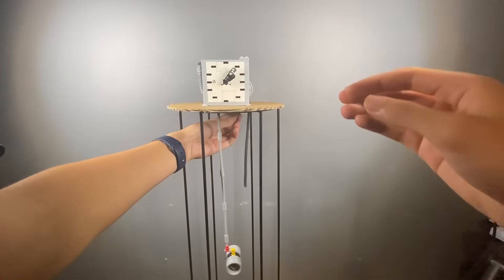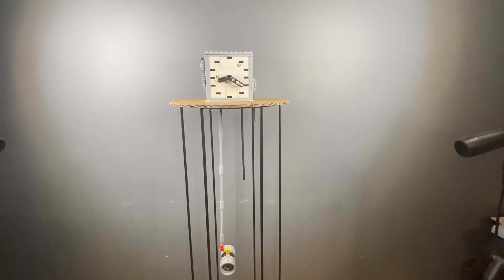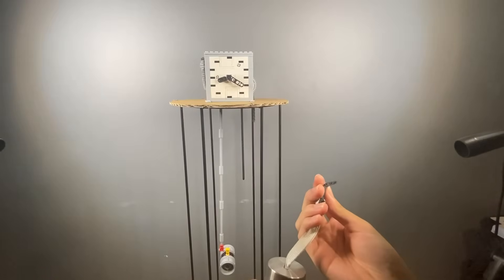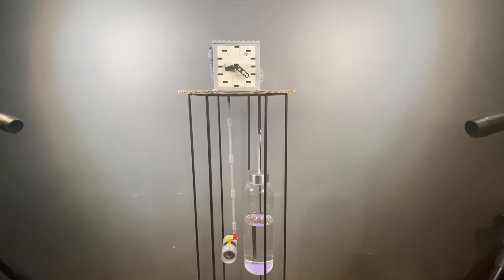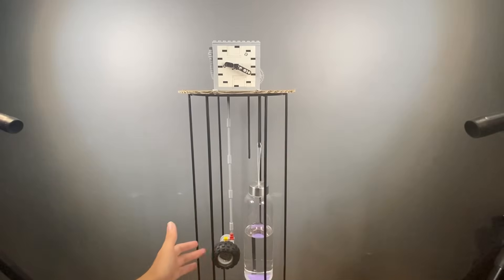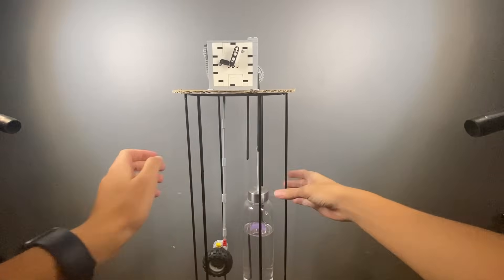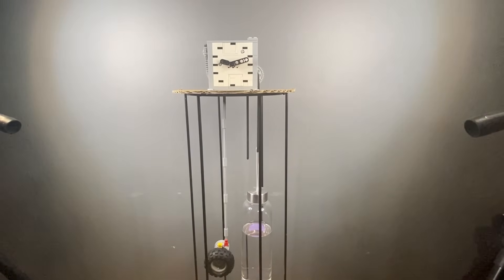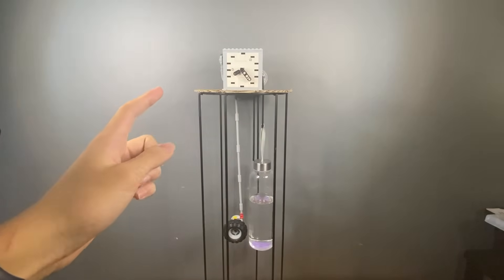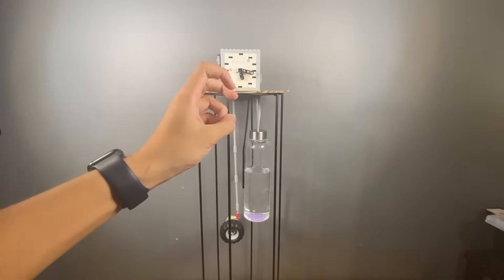So here's one, two, and let's start with three — let's see how long it takes to oscillate. It's a bit fast. That's a lot closer — add just a tiny little bit more and that's pretty much perfect. The pendulum naturally leans a little bit, so we're going to attach a little piece and just offset the weight by a tiny bit. The next step is to attach the weight — I'm going to use some of these chain link pieces and thread them through. Now it's time to attach our weight using a drink bottle filled with water. It's working! Let's see how long it can actually run for.